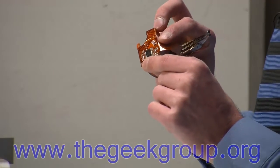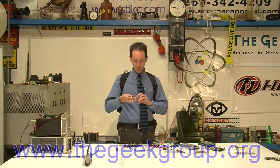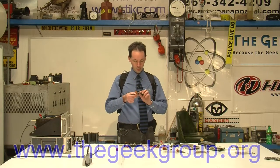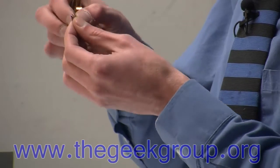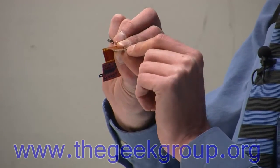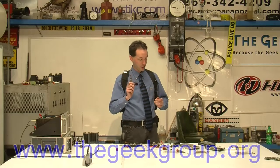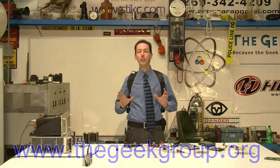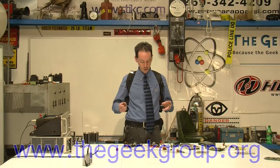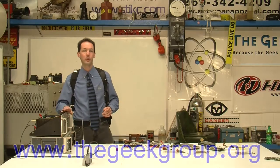There's usually a chip here — I have no idea what the chip does, but it's something very important. The wires that go to the motor won't go to the chip; they'll usually go around the chip or whatever, and they come out on the other end. Usually on one end there'll be a ground and then the first two — and those are the wires you want to connect your amplifier to. Now, you need a speaker-level output. If you just hook this to a headphone jack on your laptop or something like that, it won't work — or if it does it'll be so quiet you can barely hear it. You need an amplifier. So this will work — we're using this giant Marantz thing.